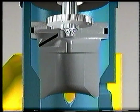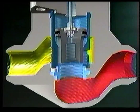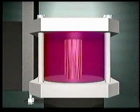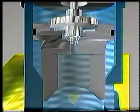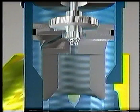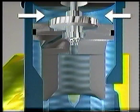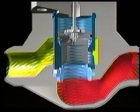In controlling the process set point, the main plug has three possible positions: movement downwards, movement upwards, and equilibrium. In a downward movement, the positioner sends air to the top of the actuator, moving the Pilot plug downwards. The outflow rate is restricted by the Pilot plug, where the inflow exceeds the outflow. The pressure in the balancing area bleeds into the control area, forcing fluid pressure to build up on top of the main plug, causing a rapid downward movement of the main plug with no overshoot.